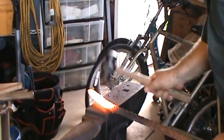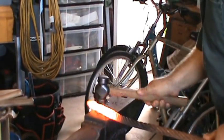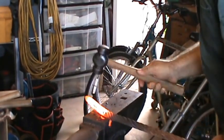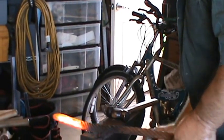One of the main things about forge welding is not to beat the spot out of it when you first start. You've got to get the jumping technique together, and use a lot of flux.